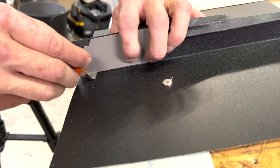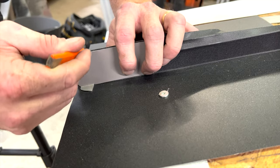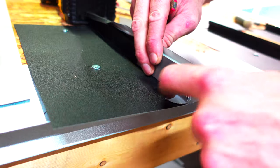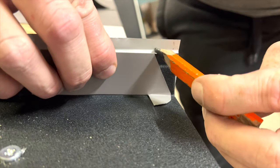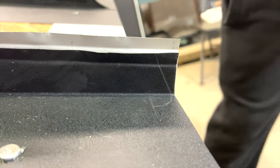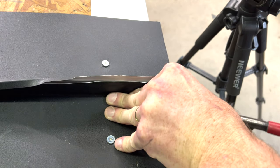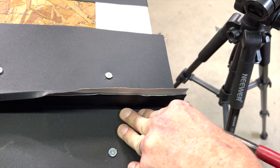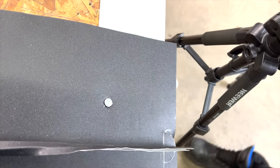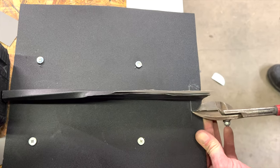It's just a tab that folds over — it's a little short, but it's okay. Making a little notch here. Lining up this back edge with that line. Just to describe what's going on: I'm using my straight snips to cut this bullnose in. I thought maybe a curved snip would be better here, but actually straight snips seem to do the job just fine.